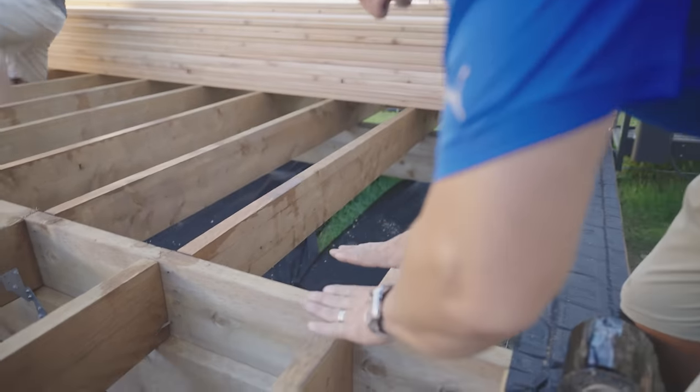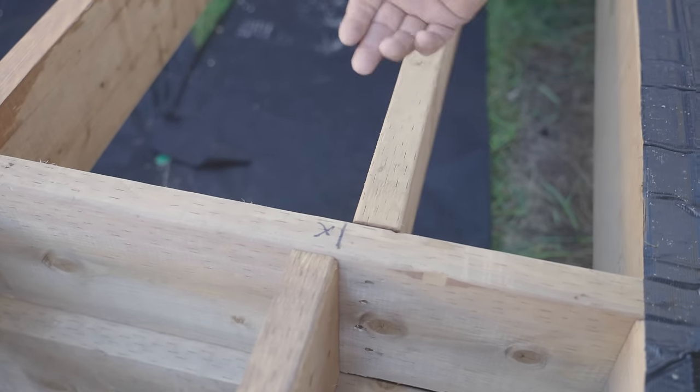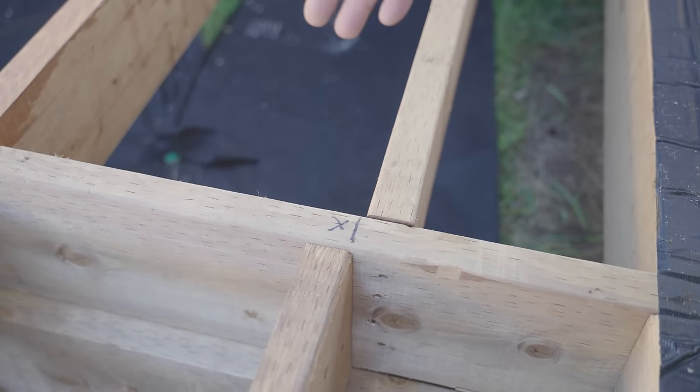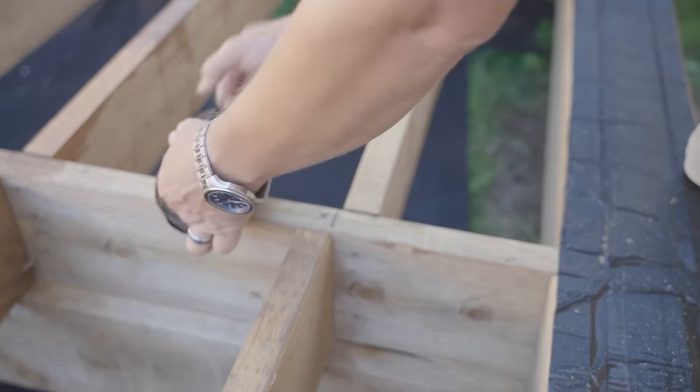As we're putting on our deck boards, if we get to a point where the water is going to land right where everything is nailed together, it's probably not a great idea because you don't want to have all of the ends of your fasteners exposed to all that rain. So if it's going to be a joint, I'm going to cover that in joist tape, just give a little extra protection. This is the location I'm talking about. So if I have my two deck boards and they land right here, for instance, that means all those fasteners and where they enter and come out of the wood on both sides, it's exposed to extra water and I can't seal that. So if that happens, I'll throw joist tape right down the middle. It's a water diversion system. The deck boards might only last 50 years, but the frame itself probably lasts 100 if you take good care of it. That's the secret.